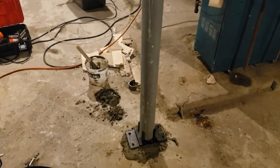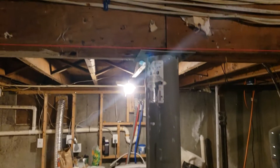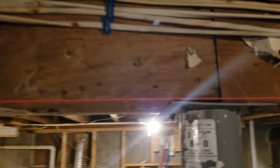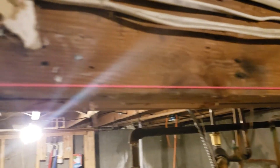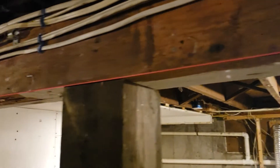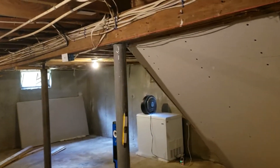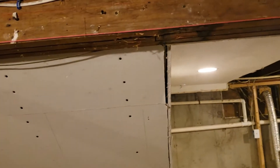First column's in. As you can see, we took out a complete inch and a half compared to where it was. That's my support hydraulic jack there. We're going to overkill this a little bit by putting a column here and another one there.